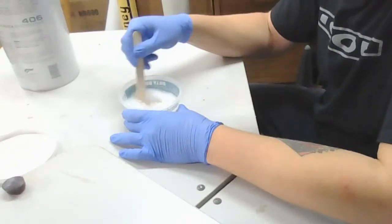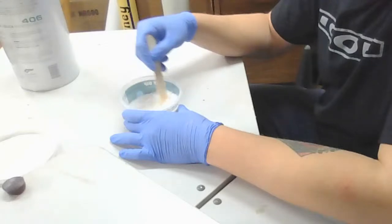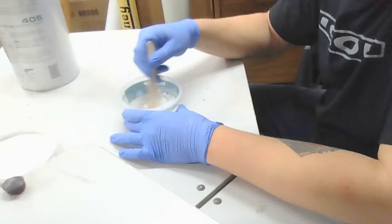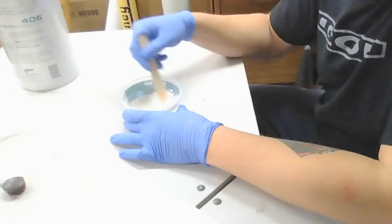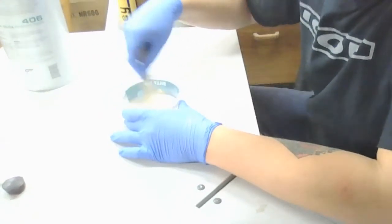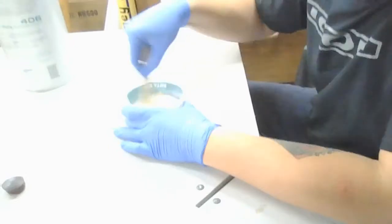We had one humid day a couple years ago when I was working on my Iris, and I was putting carbon fiber on the coupler, and I went to dip my brush in the cup of West Systems epoxy, and it was cured. I was like, what just happened? It was like 15 minutes. But you can see it eventually sucks itself down in there, and then we'll start mixing a little bit faster. I grew very patient with mixing epoxy, doing chopped carbon, because to get it where you want it is a nightmare.